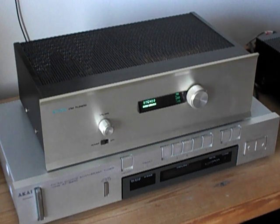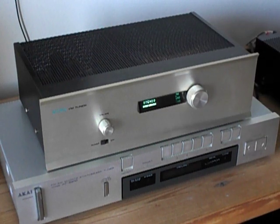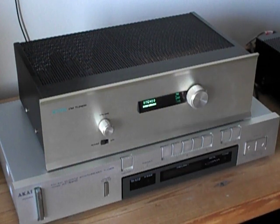Some interesting modifications. The 3 PEC modules, the 2 that are on the multiplex board, had already been upgraded to the Epperson ones that you can buy pre-made. So somebody had bought the Epperson kit that had the 3rd one near the discriminator tube, which improves the audio. They kind of sound rolled off in the highs if you don't have that. This thing just sparkles.